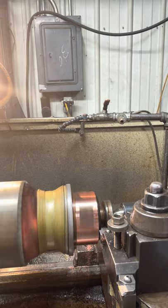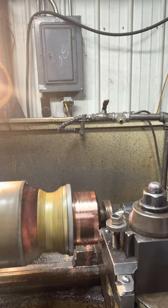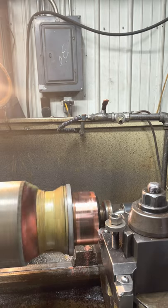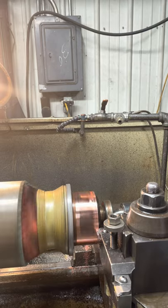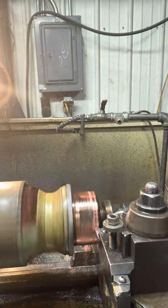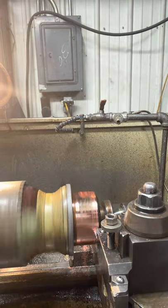Pretty deep grooves in that thing. The brush is right there. That's why it's like that. Arcing out. The more they arc, the deeper the grooves get. Don't know what causes it. Dirt, poor contact, a couple factors there. I ain't no electric motor specialist, but like I said, I've been doing a lot of these things, and they all look about the same when I get them.